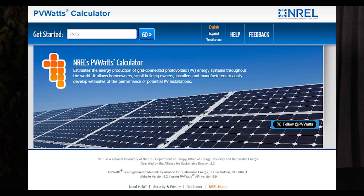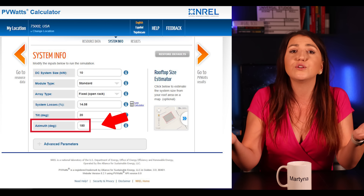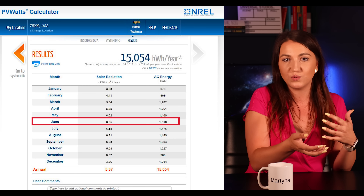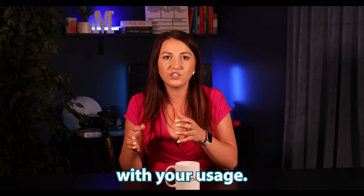For new installations, estimate your production using tools like PVWatts — I'll link that in the description below. All you need to do is input your zip code and assume a one kilowatt system facing south, east, west, or whatever direction your roof faces. Try to be as conservative as possible; you'd much rather be happy with the outcome than disappointed. That way you can see your average daily production — take the monthly production, divide it by the number of days in the month, and compare it with your daily usage. All you want to do is compare solar output with your usage, daytime and nighttime.